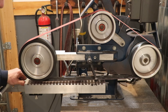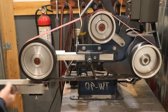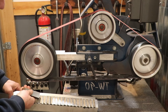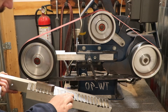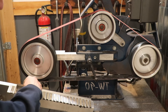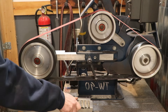Over time I think that tolerance will only get worse. It also makes a difference where you place the work. Since these magnets are epoxied in with clear 15-minute epoxy, it matters where I position the workpiece. If I have it forward in the chuck, the hot grinding dust comes off and gets attracted to these magnets, and if it's hot enough it'll actually burn the epoxy — and my epoxy is a little bit burned there. So in the future I'm going to position the work closer to the rear of the chuck, and also use a shallow piece of stock behind it to keep it from sliding.